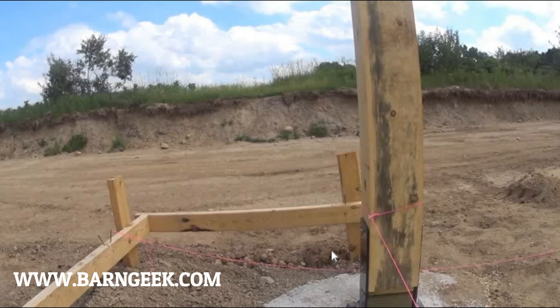You lay out these strings where approximately the outside wall will be, and then square off of that. You can see where the nail here is in quite a different place than the nails here, because the person that set these batter boards up was a little bit off. But that's why we make these two feet wide — so that we have room to move the string wherever we need to, to make the square we're creating with strings not only square but at right angles to each other.